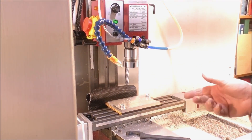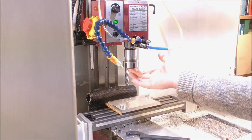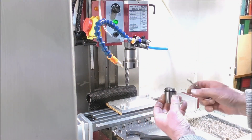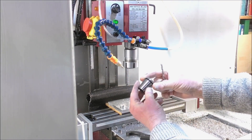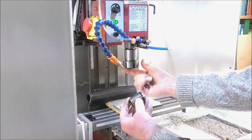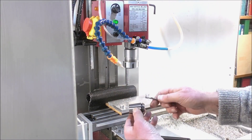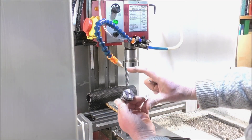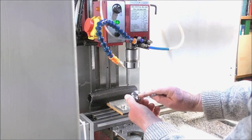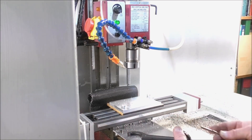Some of you might find this interesting. I'm going to change the collet, because this is a six-to-seven millimeter collet and I need to put a five millimeter drill in, so I've got a five millimeter collet here. There are two cones inside — one on the nut and one up inside — and when the nut gets tightened up it crushes down onto the shank of the drill. It's a very tight, very accurate collet.